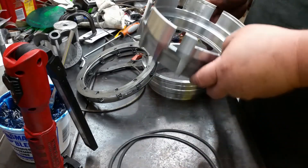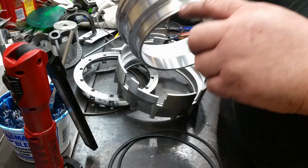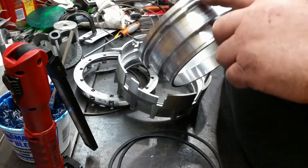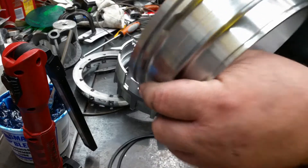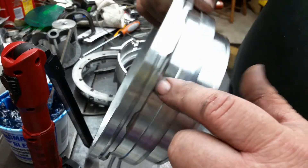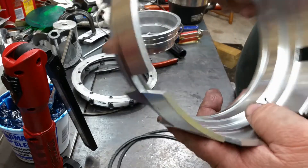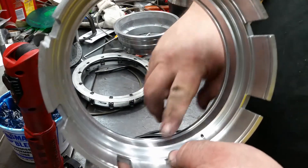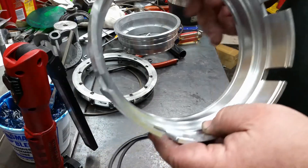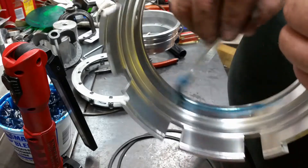On this one, it's kind of unique. This groove here is for a snap ring; this groove here is for a seal. You can tell if you look — it's actually stepped. That's how you can tell it takes the seal on this one. The step is on the inside right here, so that takes your other seal.